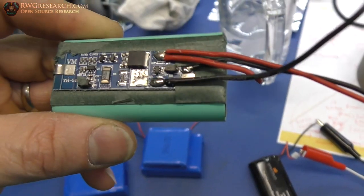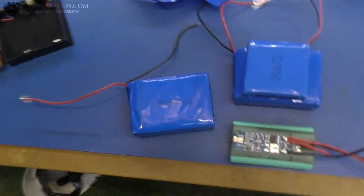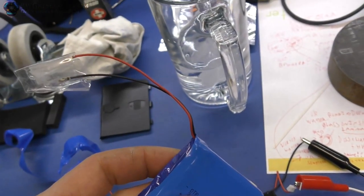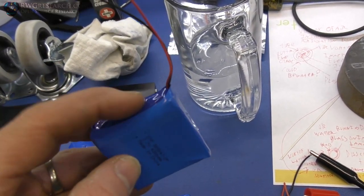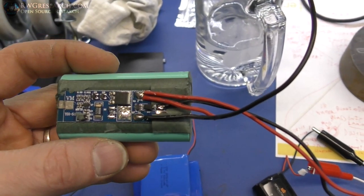There's an old battery from a vacuum cleaner and it has a charge controller built right into it. Normally on a battery of this type — say a 3.7 volt battery with only two wires — there's not a charge controller, just safety circuitry. But this one: you hook up 12 volts to it and it literally acts as a charge controller, which is pretty cool.